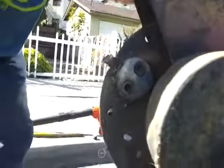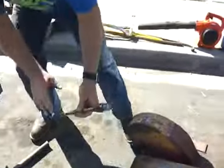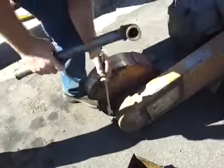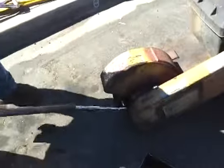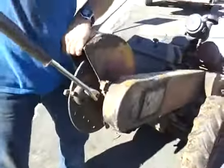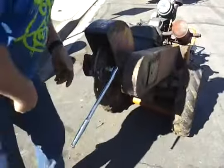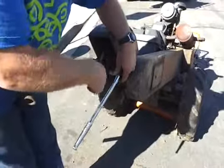Then you want to push the front end of the machine down to the ground, and then you put your tool in. You want to make sure it's in there all the way or it'll strip. You really want to get these things in there too because it's dangerous — if they don't go in just right, they can actually come off while you're using the machine and fly forward. So we don't want that to happen. I'll get these pockets loose and I'll be right back.